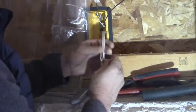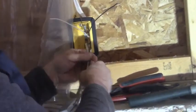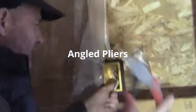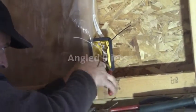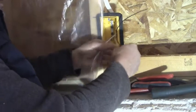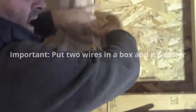I press hard at that last one inch, because then I can just use my thumb and peel this wire back, leaving one inch of insulation. I take off all the other protection, take my angled dykes right there. Now I'm left with this — I try to put two wires into a box, and that's it if I can, because it's the easiest to wire.